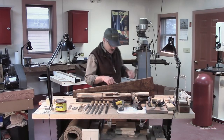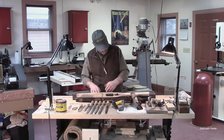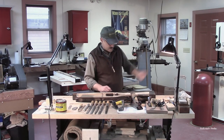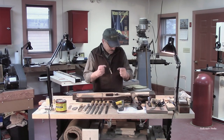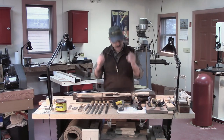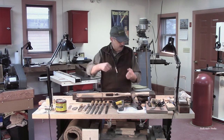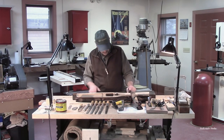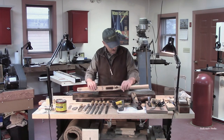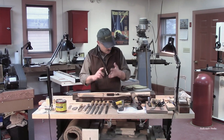The Bridgeport is just ready-made for that kind of use. My Bridgeport is a 1960s era machine — I bought it surplus, and it's all hand cranks, no CNC. It's just me doing lots of measuring and calculating. I'll eventually use the Bridgeport to cut some of those rough inlets, and then finalize those inlets with chisels, files, and other things. That's how we get to the layout and that top datum point.